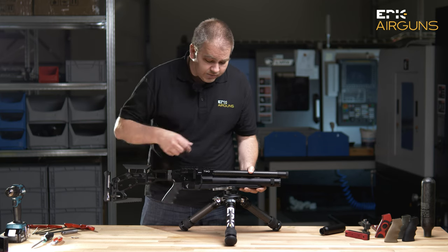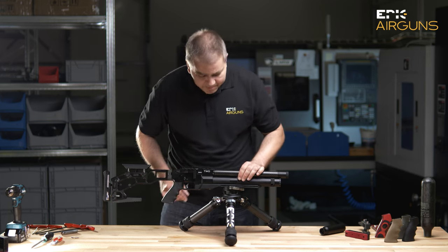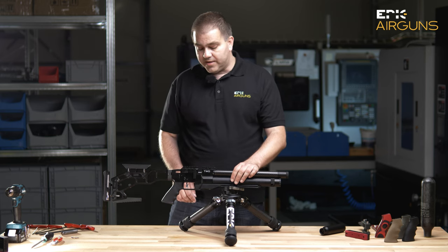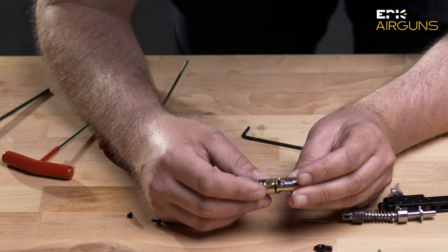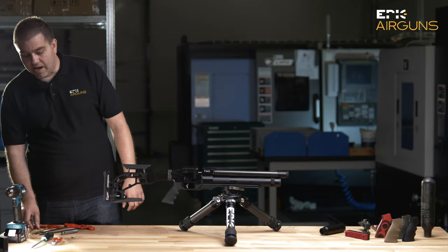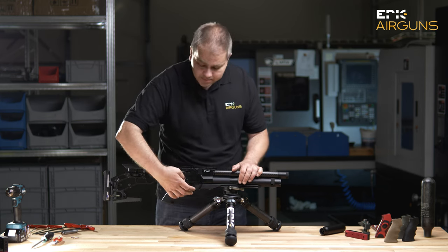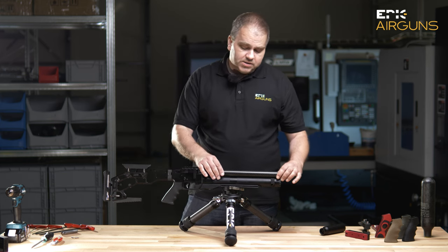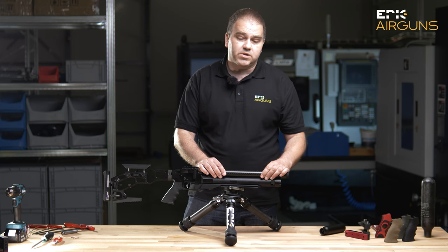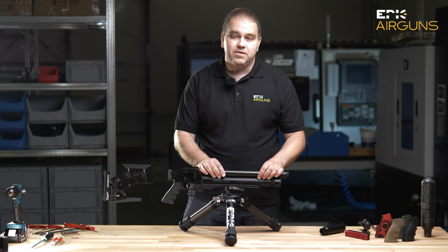There is adjustability inside the gun. In addition to the externally adjustable regulator, there is also a balanced valve system. The balanced valve system allows you to ease the load on the spring and the hammer — that's why cocking is really very easy. We are limiting the space of the air pressure which is closing the valve to the minimum, and we are actually able to time our valve closing by exchangeable jets with different diameter of the jet hole inside. The bigger the diameter, the quicker it closes the valve.